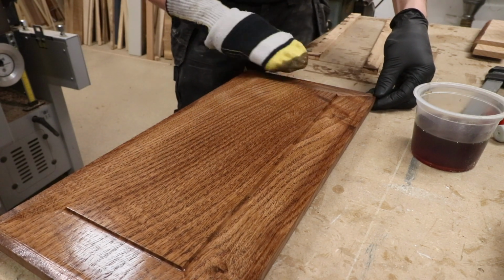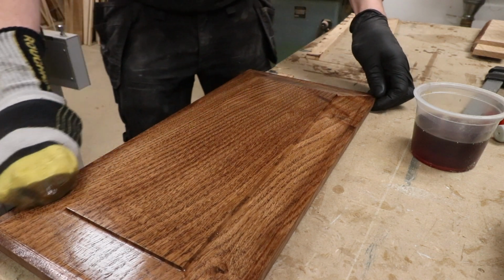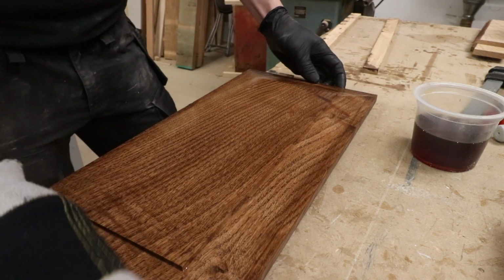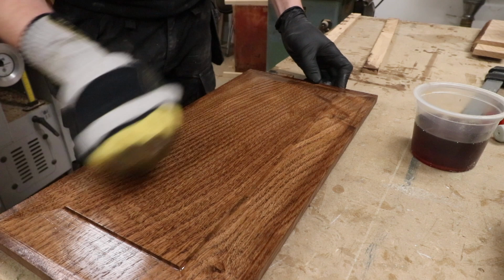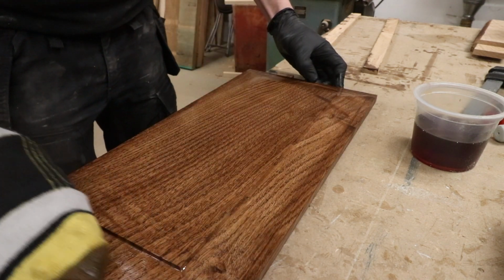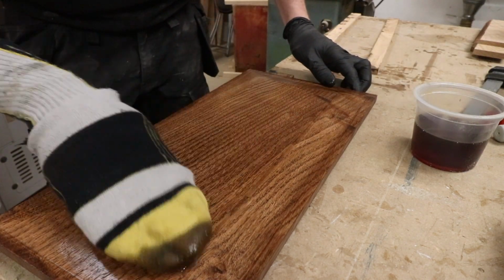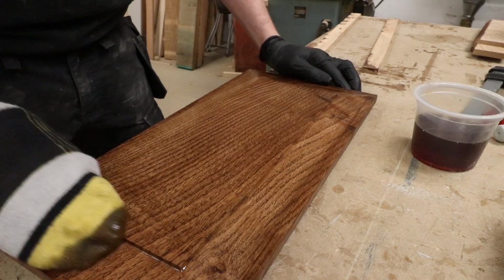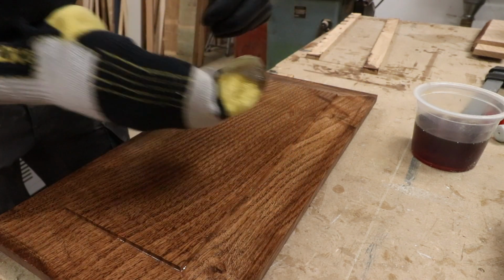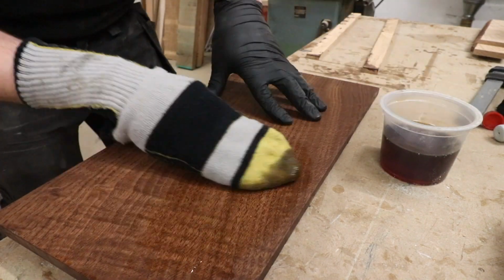If you just want a good oil, like it's been oiled, that look you get from the wood fresh after it's just had its first coat of oil, if you want that look but with a bit of protection, then about 3 coats of hard wax oil applied like this is a pretty good way to go about it. So it's soaking in quite well there, so I'm just going to keep adding a bit more in. I mean, if your special application device has ventilation holes like this one does, then that's a bit of an added bonus, but they don't need to have that.